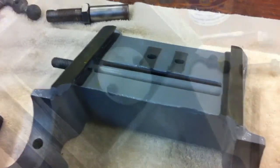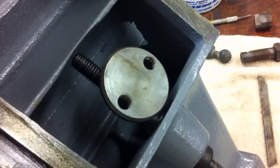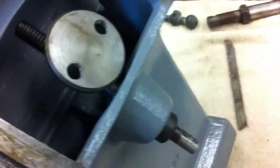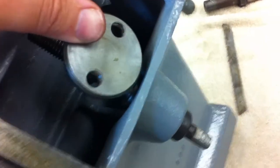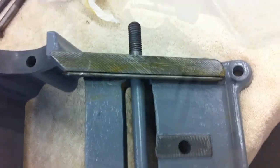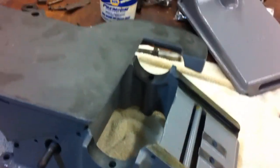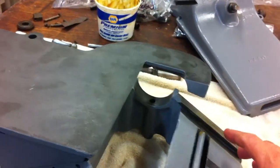and hope that goes easy. One helpful note, you'll want to make sure that you have that base already rotated over. If you can tell, if you don't, when you get it on, you won't have enough clearance to move it over. And also, don't forget to put the gib in place. Okay, got the first one on. I'm not sure if I mentioned this, but you want to bring them on from the top, and they go down.